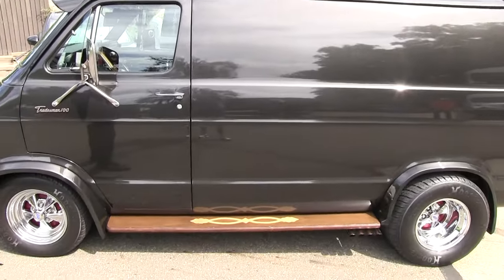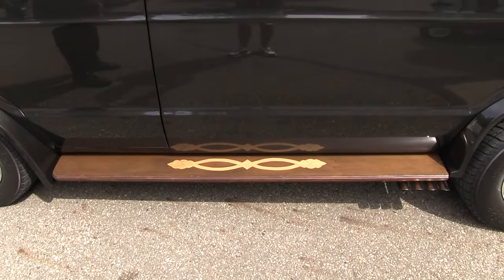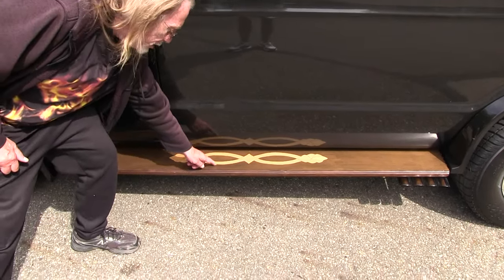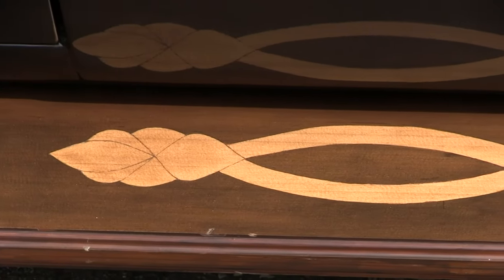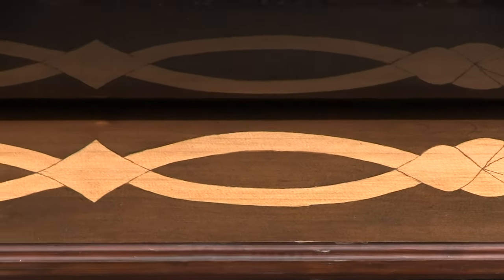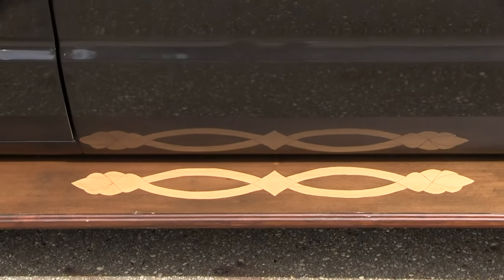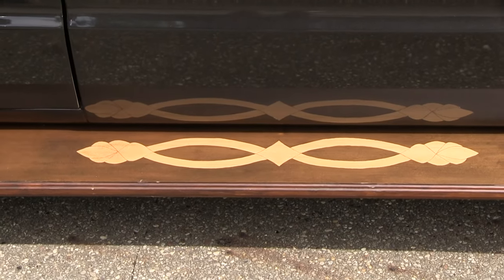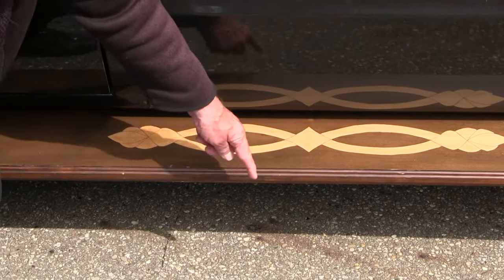Running boards there — that's cedar, and what appears to be an inlay in the board. If you feel it, there is an edge and it feels like there's an inlay. It's not — the wood is that soft. I just took a pocket knife after I did the drawing and cut it, dug right alongside it, and then I took stain and stained around the actual board itself. This is the color of the board itself; this is the stain.